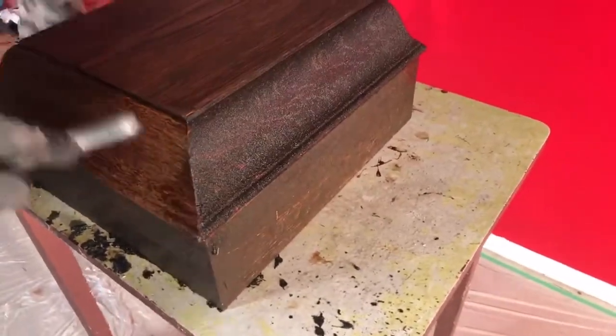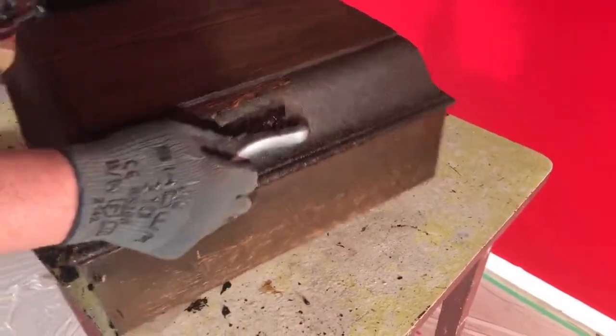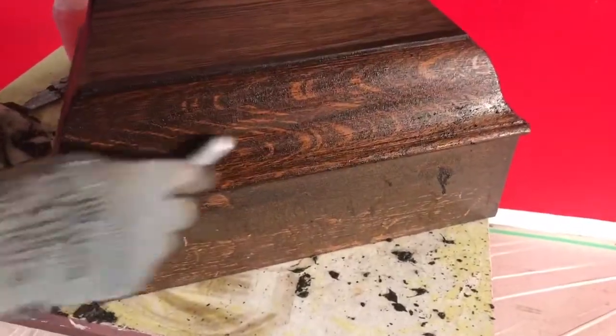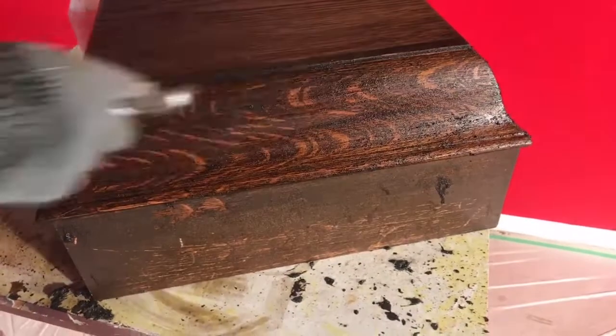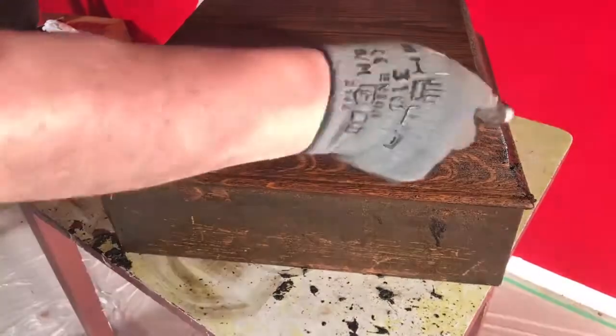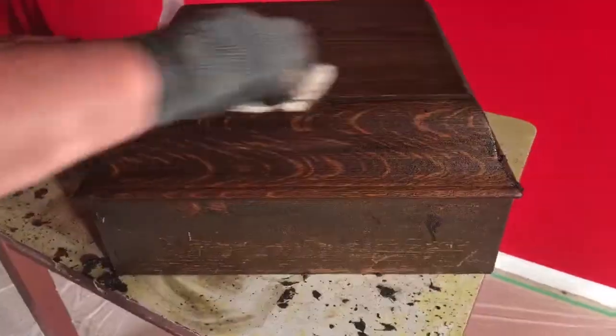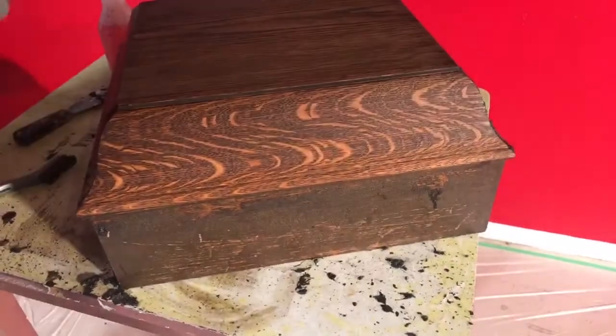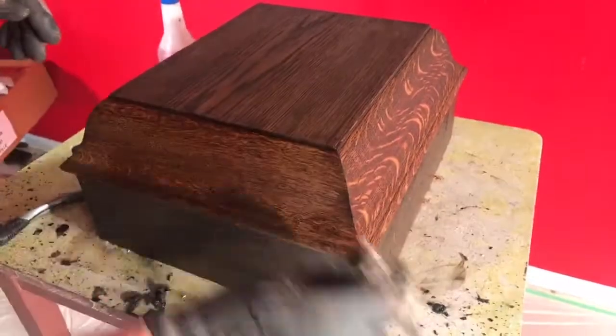As we came into the video, I don't really want to splash it all over the wall, so I want to turn it. The stripper is virtually pH neutral, so it's ideal for antiques. This is a very good example — there's so many things that you could apply this system to. This is oak, there's your curved mouldings, all sorts of stuff. Very, very easy to restore using this. This was one of the original uses for the product when I first developed it — antique restoration. You want to be able to remove the finish if it needs it, but you don't want to take the character away, the patina. So that's part one complete, which is taking off what's on the surface.